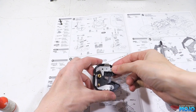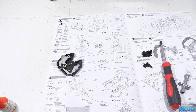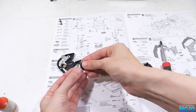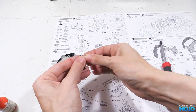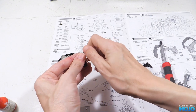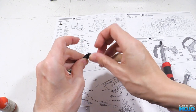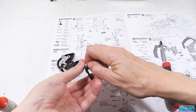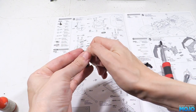As a quick test, the lever should move freely and spring back with a nice snappy action. If it's slow or sticky, find out why — keep in mind the screws aren't tight yet so double check when they are. Next we fit the MFC switch cover. Even if you're not fitting an MFC, I like to have it ready so a switch can be added later. To fit the press nut: press it into its hole teeth first, then thread in the M3 by 10 to pull it into place.